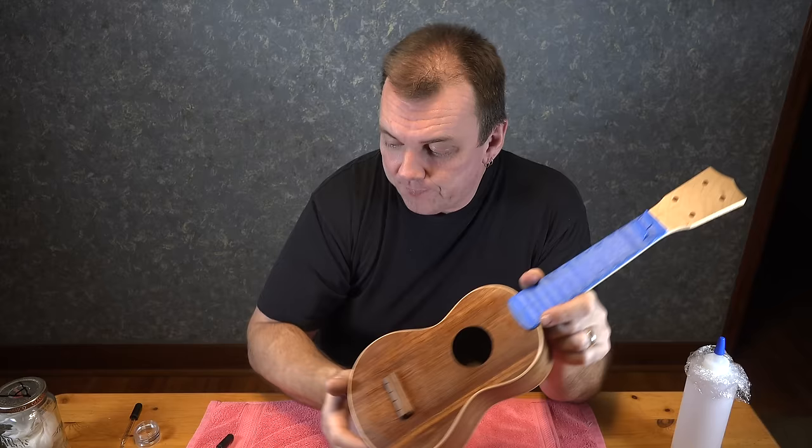It's difficult to get in there and get the shellac applied, but it's even more troublesome to try and do the spiriting. So I'd just like to point out that although there are those that would say spiriting should be done with the grain, there is absolutely nothing wrong with going cross grain or even little circles for the spiriting to remove that oil. You could always clean it up later.